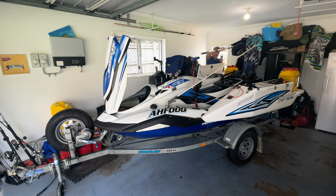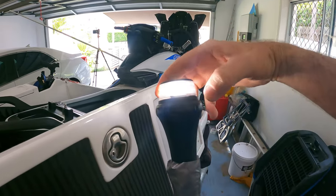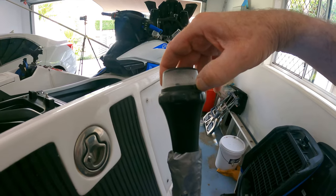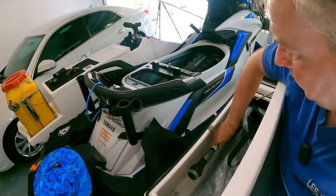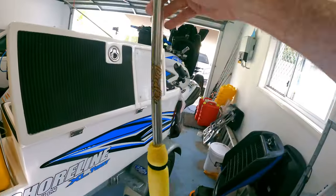The other things I carry in this side of the tubby include my nav light — a Railblazer nav light. What I do most times is just check the battery is okay. It's got a little button; make sure they're shining brightly. The Railblazer has three settings: bright, medium, and a flashing setting. Make sure it's turned off before you stow it.